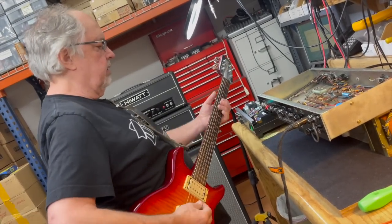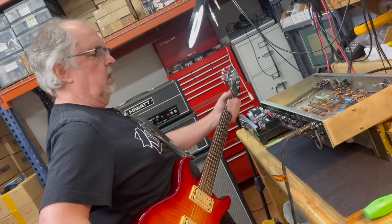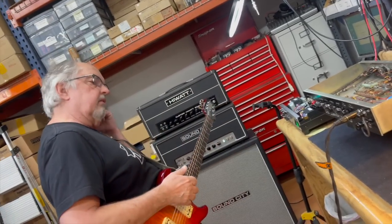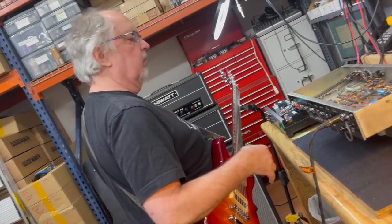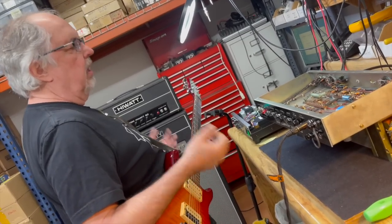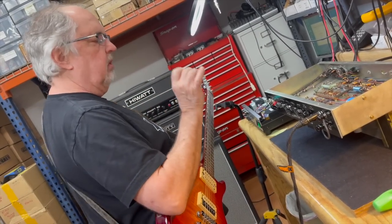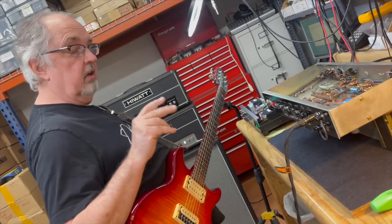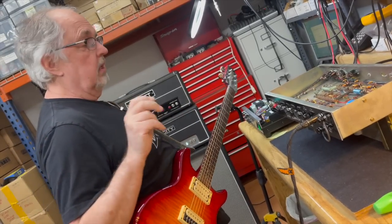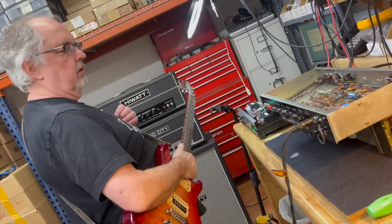It's got that tubby character. And the owner of this commented that he didn't care for that quality of it. And when I saw which version it was, I thought, well, two things are going to whip this into shape. One of them is possibly doing that mod variation, which involves two resistors. And the other one is going to be retubing it.